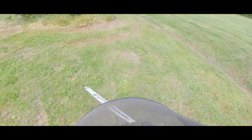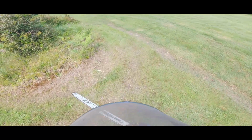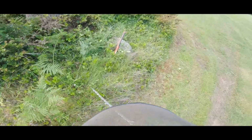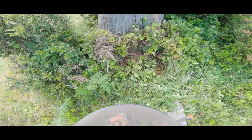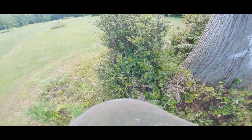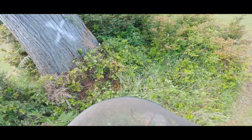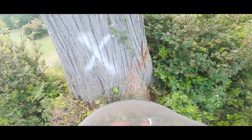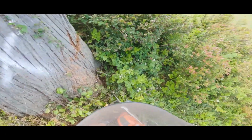All right, we got this saw sharpened back up and the raker's adjusted, so it should cut really good now. Didn't realize I hit some steel back there on another tree, and it was just cutting pretty bad on this. So anyway, should be cutting good now, and we'll start getting in here and getting this face out.